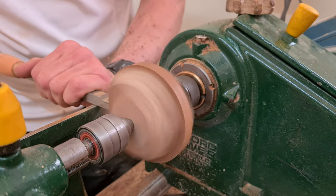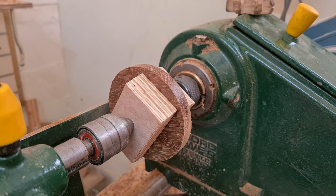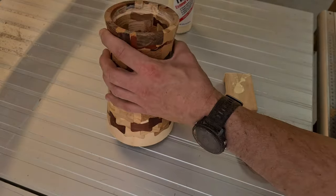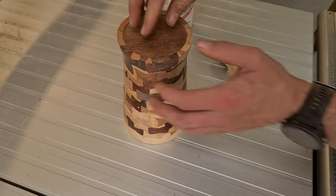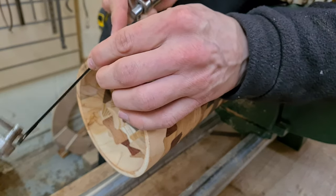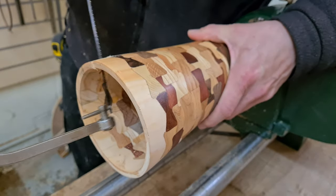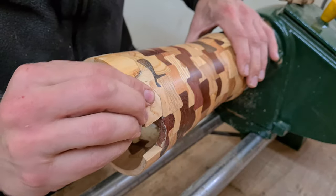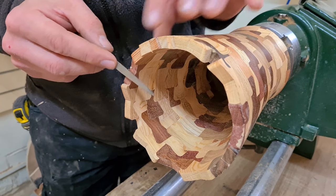Going through the finishing sequences: all surfaces are sanded, sealed, sanded again, then polished. A nice little slab of mahogany was sparingly glued into the recess in the base, being careful not to cause an overspill inside. Into the final stages, we're glad not to have glued in that top surface of the rim bow ties — just a couple of relief cuts and the sacrificial wood falls out, like pulling a very loose wobbly tooth. Then a tiny bit of touch-up filing or sanding, a little polish, and the project is complete.